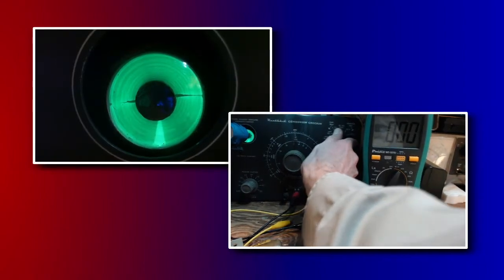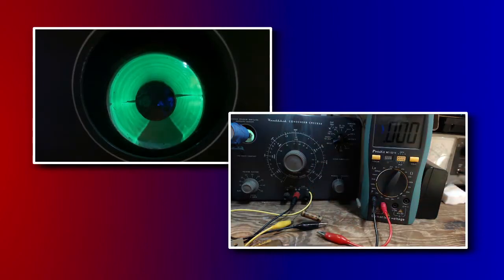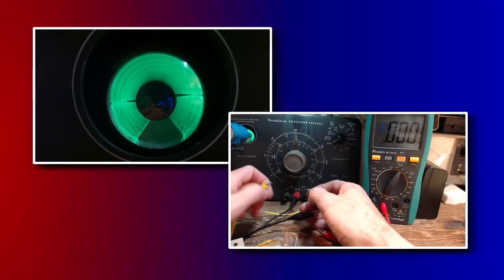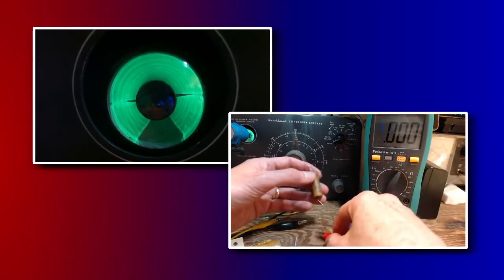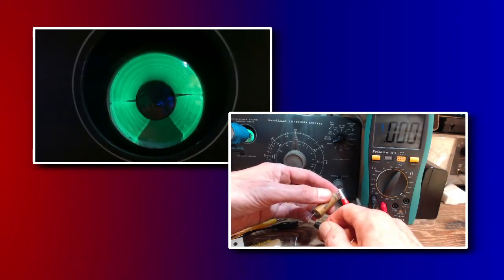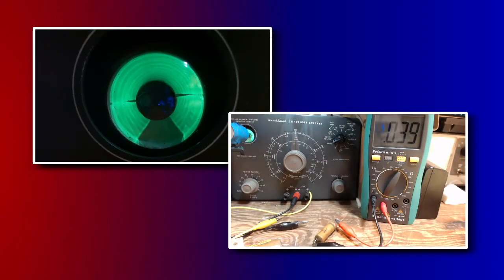Yet the leakage on here was okay at 25. Already bad news at 150. Wow, so this is good that we got this capacitor out of this radio. Absolutely. This was probably causing problems. The thing about the coupling capacitor to the grid of the output tube is if it's a little bit leaky, the radio may sound just fine. Meanwhile, the output tube is running unnecessarily hot, and you're literally wearing it out. Okay, and you're drawing more current through the radio circuits, and if there's a transformer, from the transformer all around here, you're giving your radio a hard time.